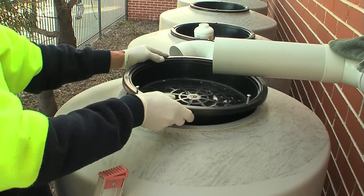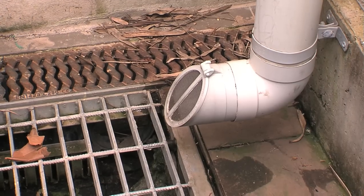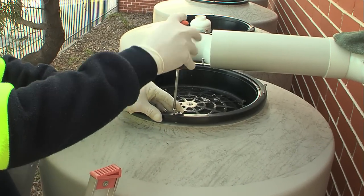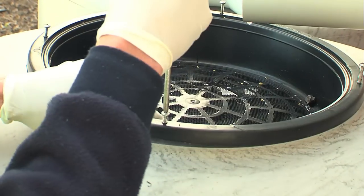It's vitally important to keep mosquitoes and other creatures out of the tank. Every opening to the tank — downpipes, overflows, accessways — must have covers that prevent mosquito entry, either solid or meshed with a maximum opening size of one millimetre.